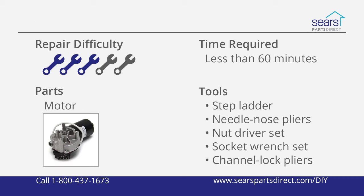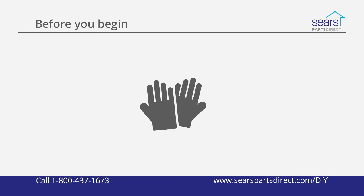The motor spins the pulley that moves the trolley along the rail to raise and lower the garage door. If the motor doesn't work at all when activated, you can replace it using the steps in this video. Wear work gloves to protect your hands.